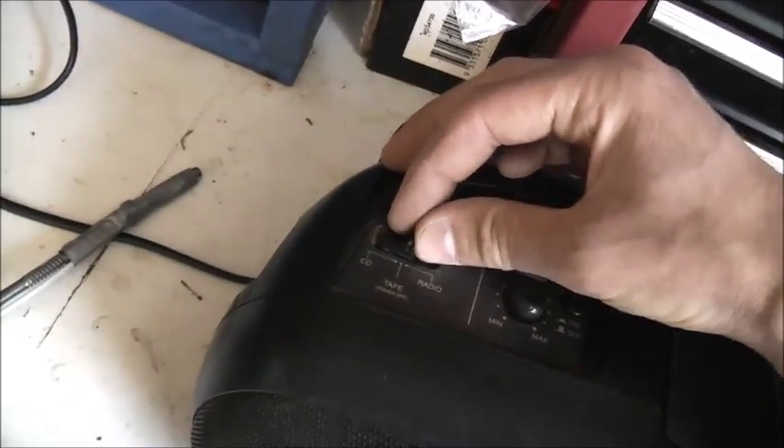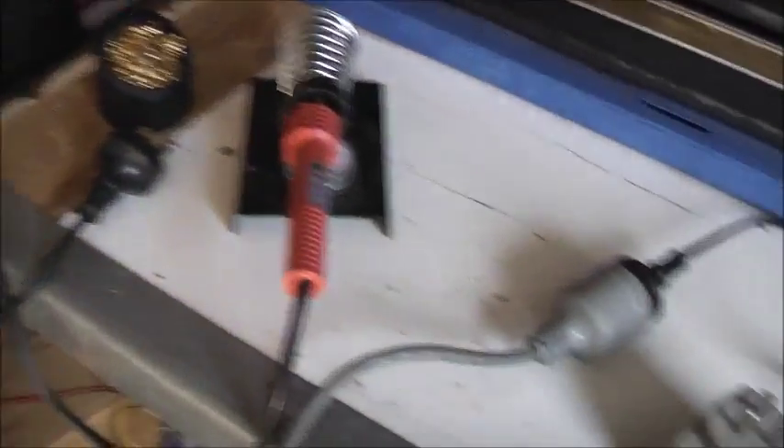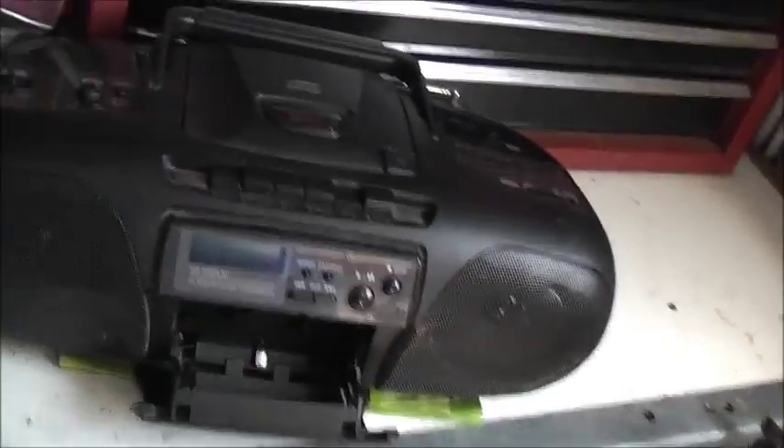Still puts a head down there. AC is perfect because it throws all the field around there, giving the head a chance to be demagnetised. So I'll power this on. If I plug this in I should get some 50 hertz hum from the speakers. I've tried putting the tape in this thing and checked the music — it's all fine — it's just the head must be bad in this thing.